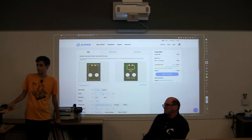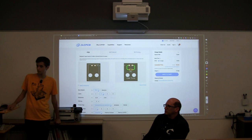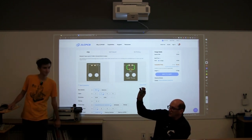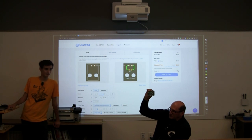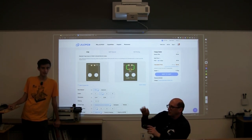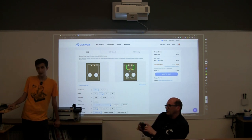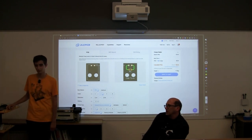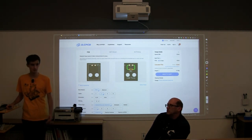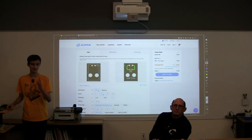Were there power concerns with the board you designed, considering how low the voltage goes on those lead acid batteries? That's the reason for this board. It has a power supply on it that can operate down to 4 volts, so 4 to 16 volts, and it regulates the voltage. That's useful for the Pis, because the Pis need a certain amount of voltage, even with non lead acid batteries. Yeah, exactly. So that's all.